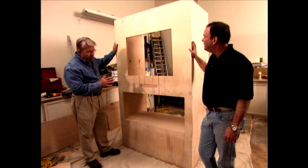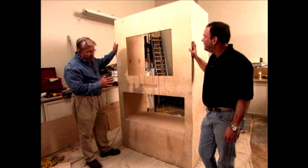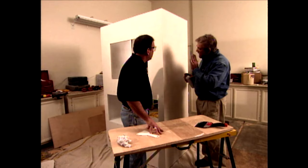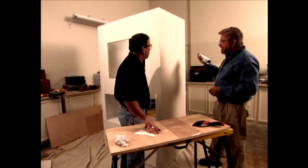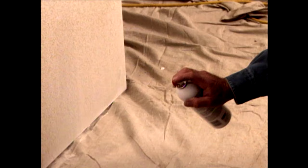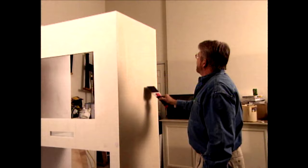We're pretty much finished with the case. Now we've got to make it look like the walls. I'm going to roll on a diluted joint compound and paint mixture that will give a semi-rough texture. That's a decent starter texture, but it's not going to match the walls in the living room. We need to add a splatter texture on top — I'll try this aerosol texture in a spray can. This can be purchased at most home improvement centers. I hold it about 18 inches from the surface and move the can in a circular pattern. After the material sets for a few minutes, I use a drywall knife to knock down the high spots. When the texture dries, we apply a coat of paint and move the cabinet inside.